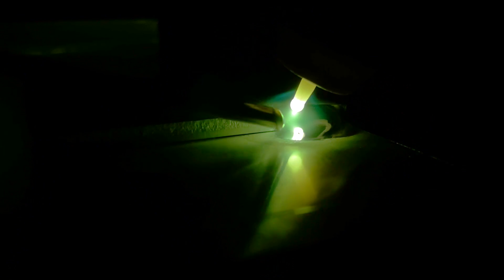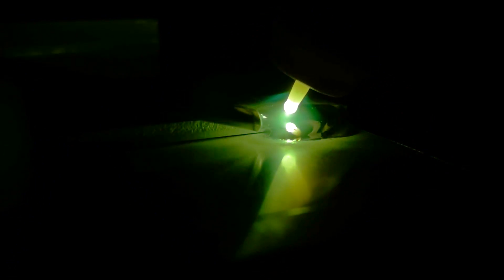As you start welding, just try to duplicate everything you did on the other half. We want the bottom line to run just as straight and in the same position as the other side. We want the details of stepping to be exactly the same. We want the amount of filler material to be bang on to what we used on the first half. And as I'm finishing up here, this is where it gets fun.